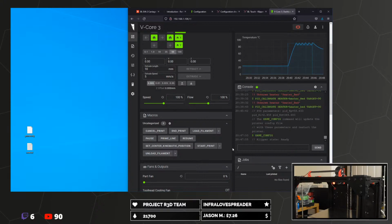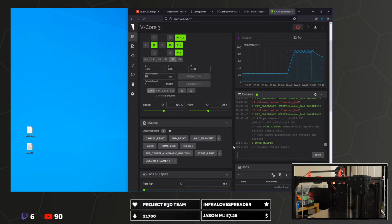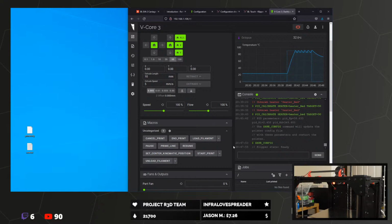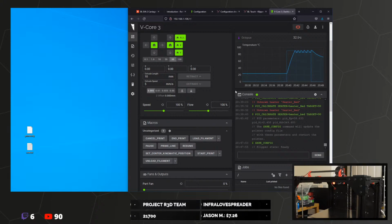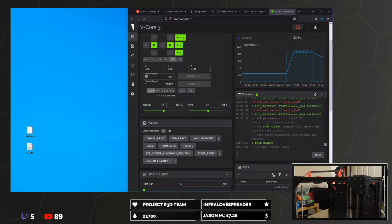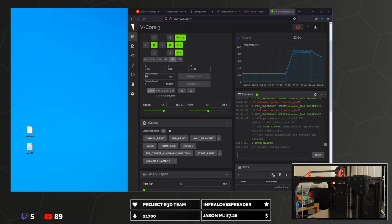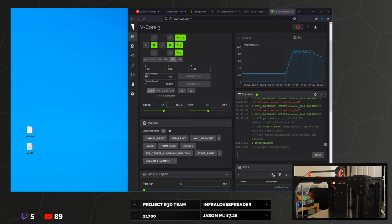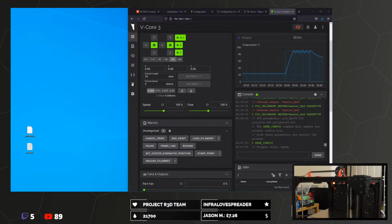Well, we're trying not to confuse... It's not the y-axis. That's a bit of a language confusion with X, Y, A, B and what Core XY is doing. Your A and B motors in combination control the X and Y principal axes of motion. X and Y directions don't change, they're always X and Y. Unless of course you're using polar coordinates, but we're not.